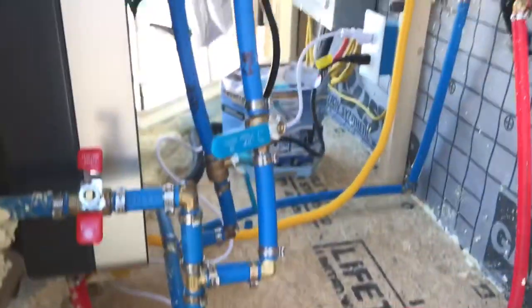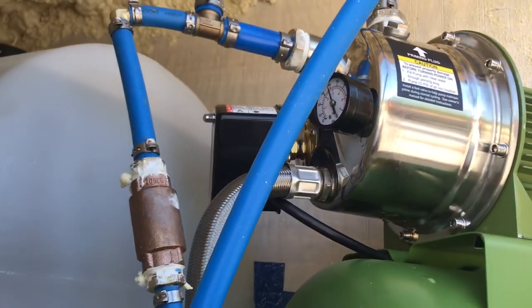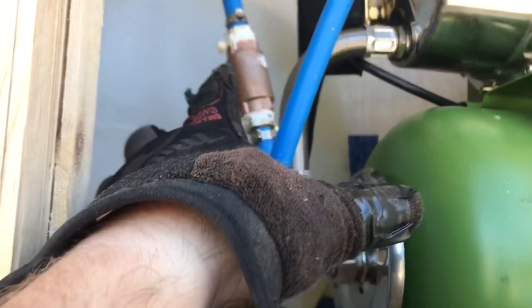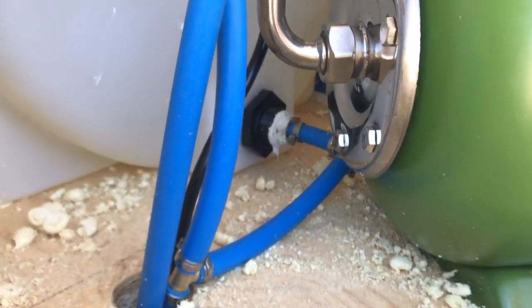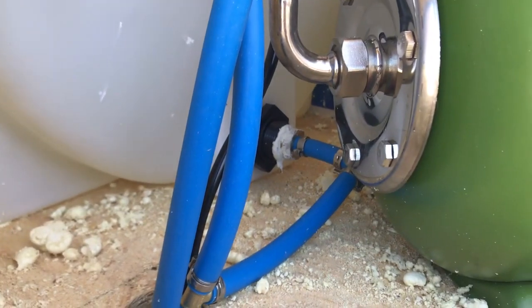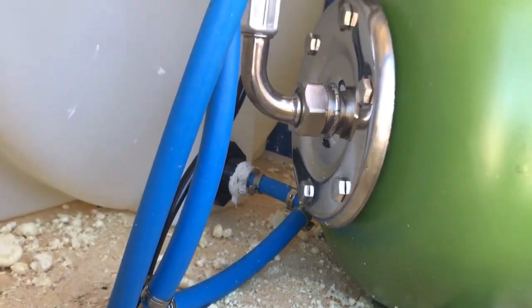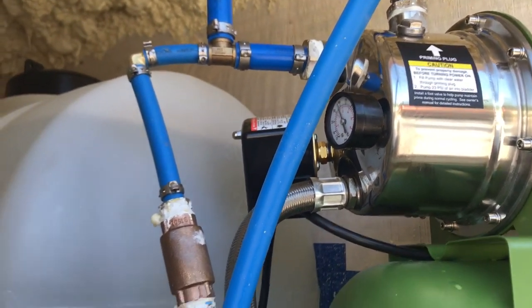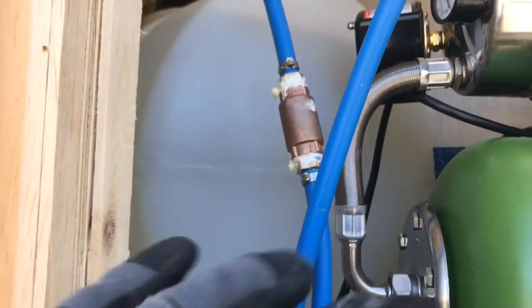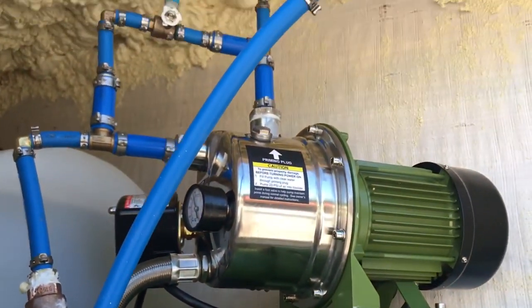The pump just plugs in because it's all automated and it already has a pressure regulator on it. All you have to do is have a check valve in line right here. The water coming up from the bottom — from the city or your water source — goes straight into the tank and tees up into the front of your pump, so the water going in can come right back out the same way it went into your tank, and then it will pump from the pump back out into your water system.